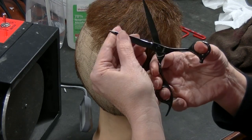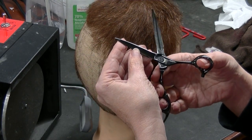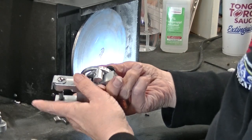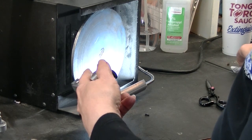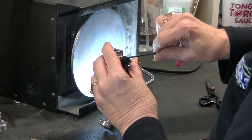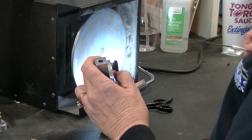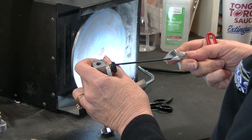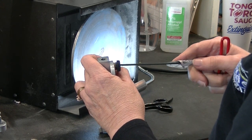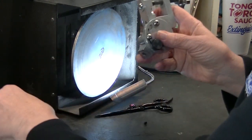Let's do the scratch test and see what angle these were actually sharpened at. I'm going to set my clamp and guess at what the angle might have been. As blunt as these felt, I'm thinking they were sharpened at a 35 degree angle, so I'm going to set my clamp at 35. I would think 40 to 45 would have been the correct angle, but let's set it at 35.